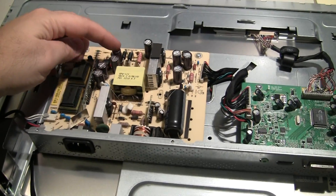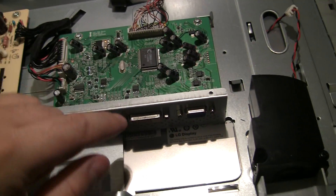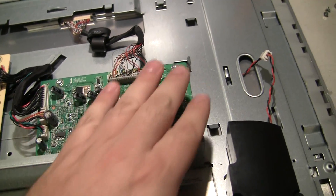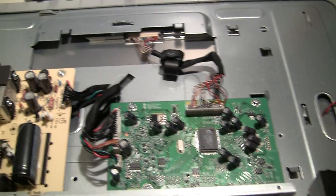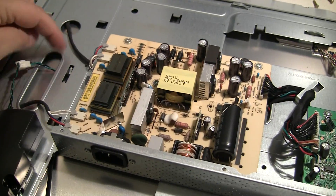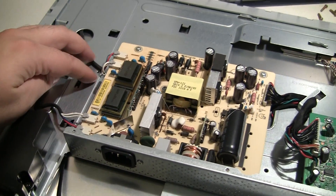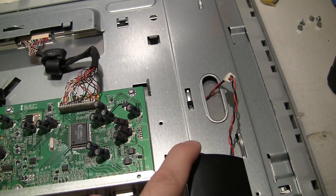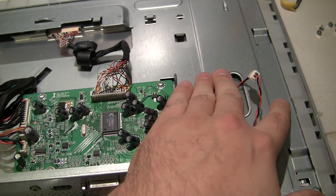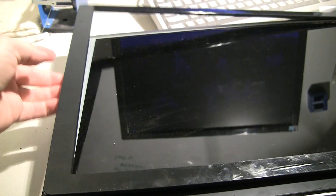Covers are off and I see nothing wrong with the caps — they all look perfectly fine. If I remember right from the video, the noise was coming from this side, and it looks like these would be cold cathode tube connections over here. Nothing really over here would be the digital board and speaker. This is the side that was a little dim, so I might need to tear into it further just to see what's up.